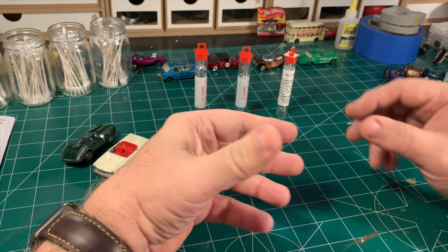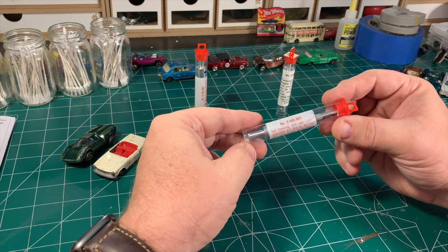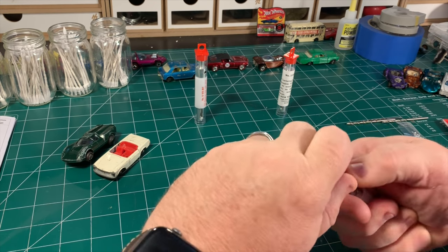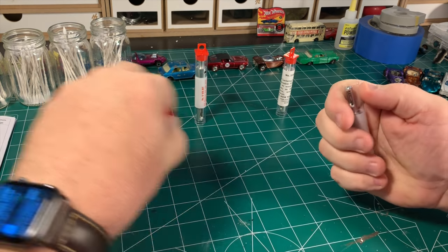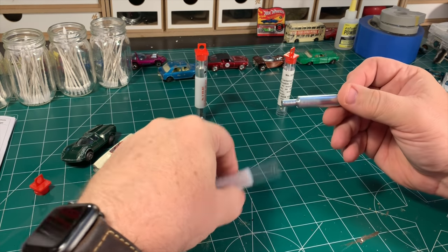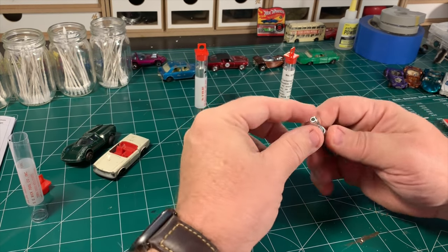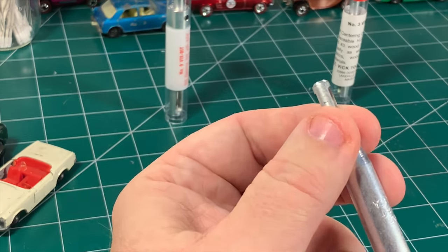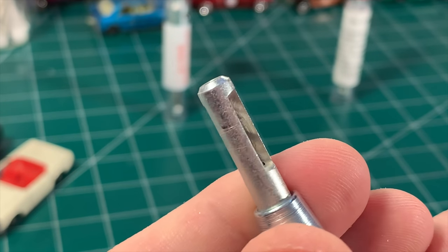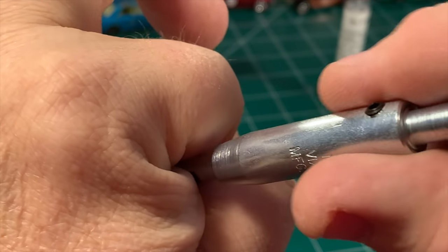And so what I decided to do is turn to one of my other skills, woodworking. Now, this is called a Vix bit. This is a number 5 Vix bit. And this is for consistently placing hinges in cabinetry. What you would have is your cabinet, and you'd have a plastic template filled with little holes. And here, let me zoom in for you. Okay, you see this little tapered end here? This tapered end would fit into the hole, and it would kind of center it.